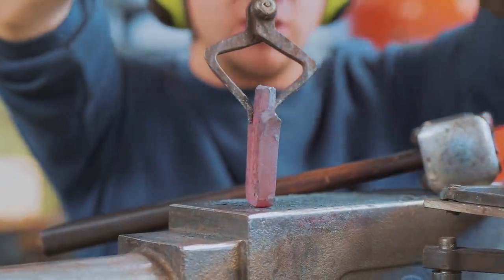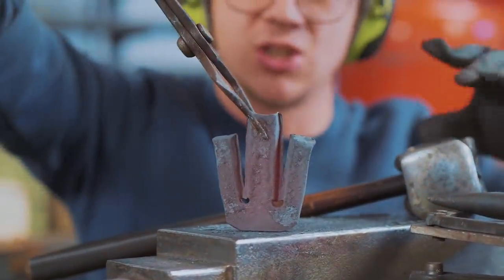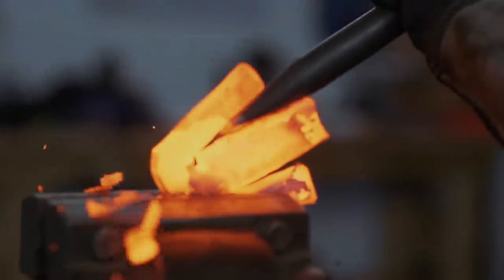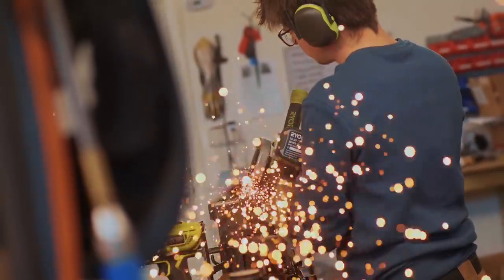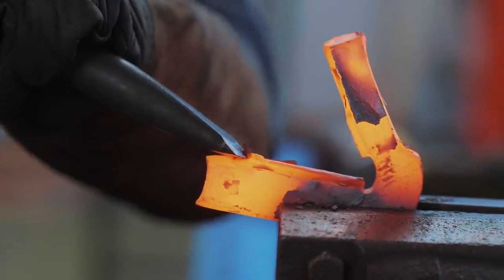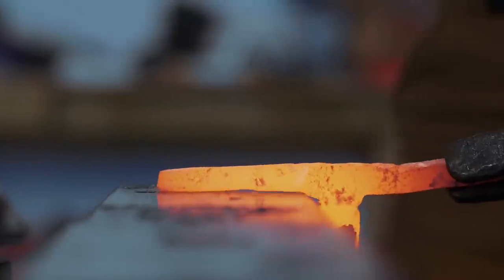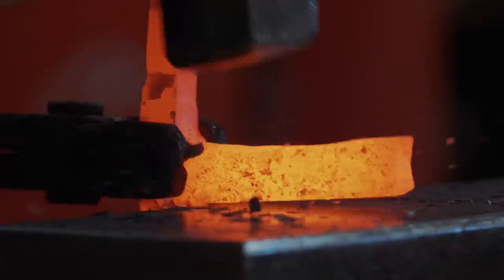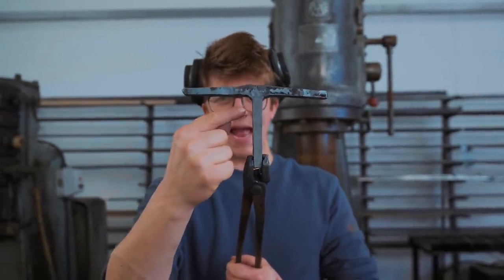This split has turned out pretty rough — you can see there is a lot of rag on these inside edges, caused by not lining up the cuts very evenly. It's going to require a little bit more cleanup. What we've got to do before we can clean it up is open the tines out, so we're going to lock it in the vice and use the chisel and some tongs to pull them out. Grinding or chiseling the rag off — maybe a little more authentic to the time. I think we're on track to have this thing nailed to a tee.